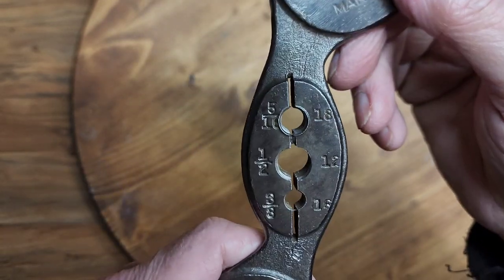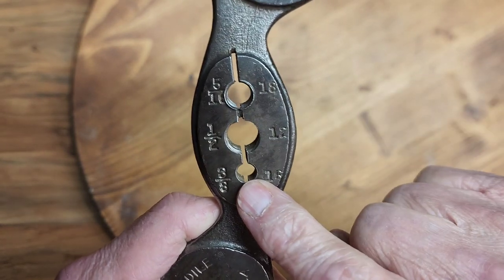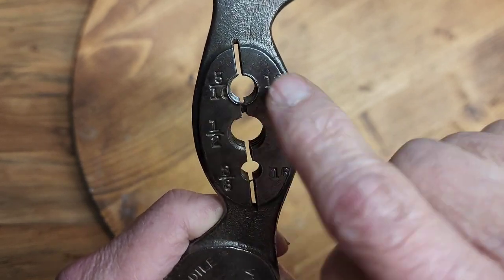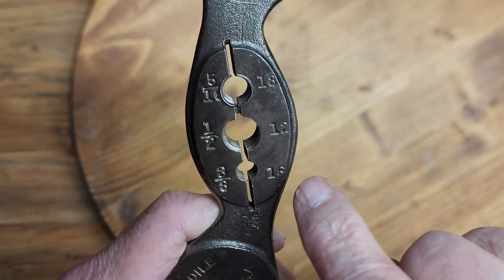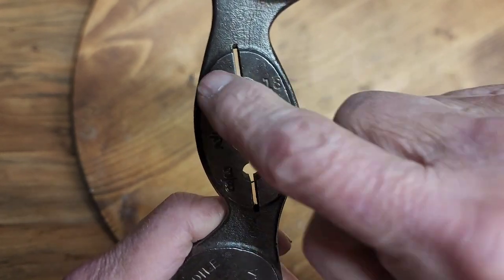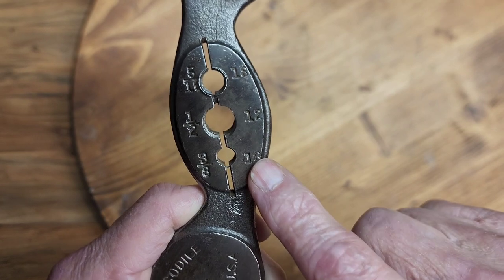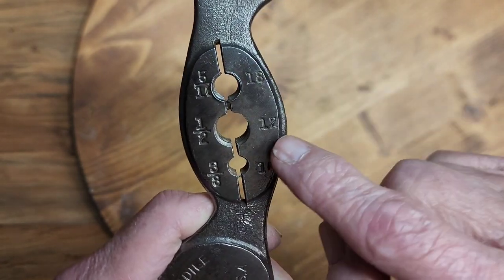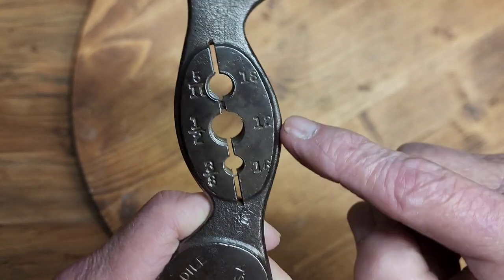The worker might have had a bad Monday. The wrench was made right — the sizes, the material — but the worker must have been hand-stamping these sizes. So the worker would come along and stamp 5/16ths by 18, which is correct, and 3/8ths by 16, which was correct. But what he did was put the wrong sizes on — picked up the wrong stamping tool and stamped it wrong. And the 1/2 by 13 labeled as 1/2 by 12 — there's no way they would have made standard U.S. sizes and then used a British size on here. I think he just used the wrong one.